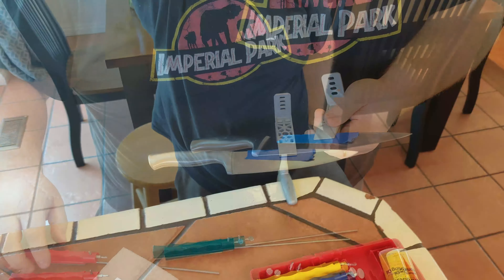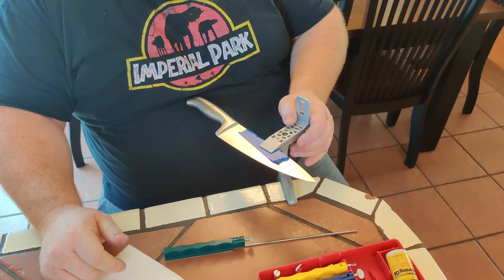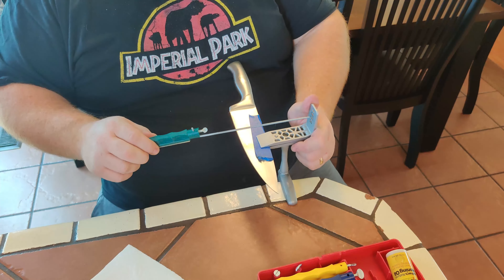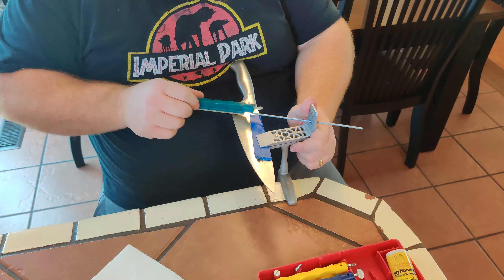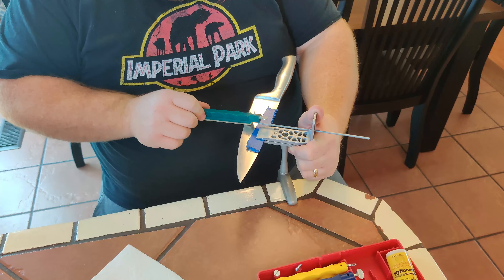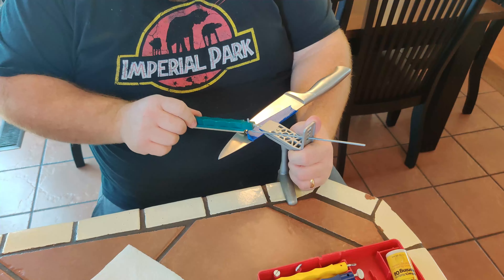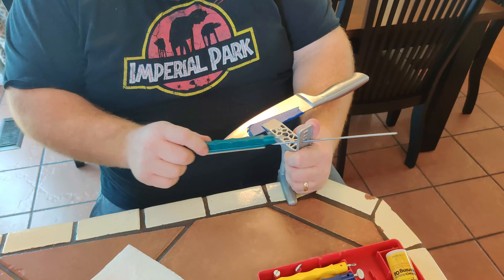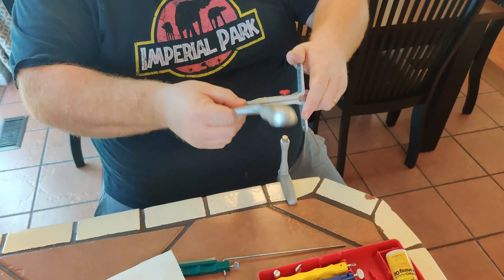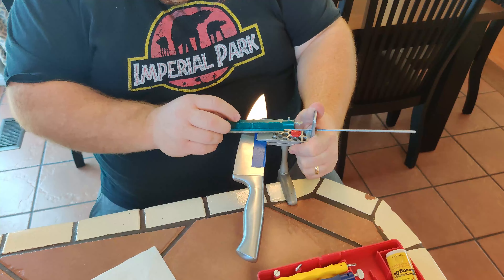It's going to take a lot of work. I've worked it down with the coarse stone to the point where all the Sharpie is gone. So I'm going to take my medium stone again and now work it the same way that I showed you to begin with — not pushing very hard, just enough to get this knife working correctly. I've worked that twice on that side, let's work it again on this side.